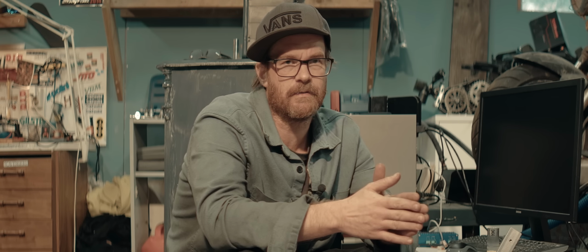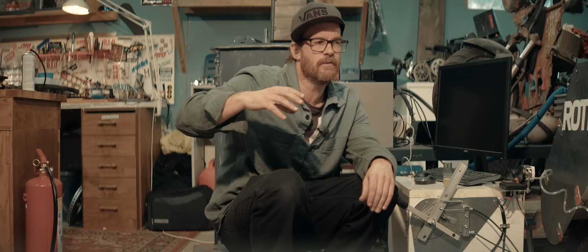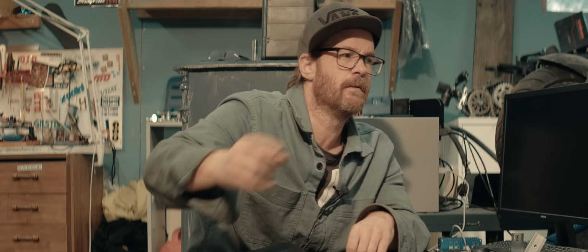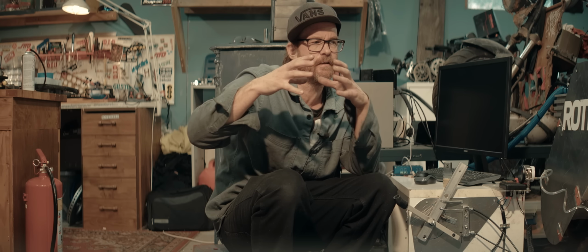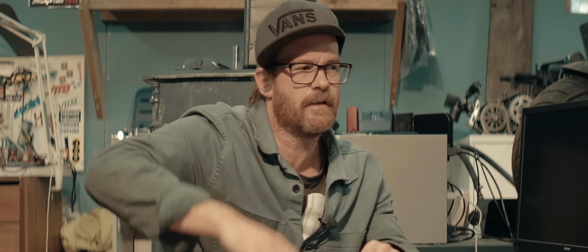I think the problem is what I was talking about when I was ranting about EFI in the previous episode. How the mixture that enters the crankcase in one cycle is not what's used in that cycle. It can take many cycles until that little package of air and fuel enters the cylinder. With this huge crankcase volume, there's so much mixture just sitting there and the fuel is falling out of suspension. All that fuel is just puddling up around in the case, and sometimes it enters the cylinder, sometimes not.